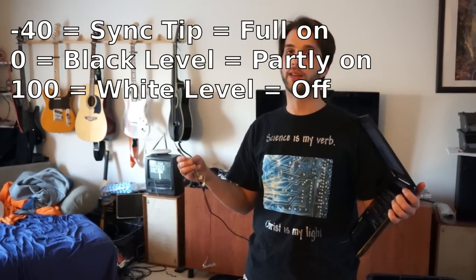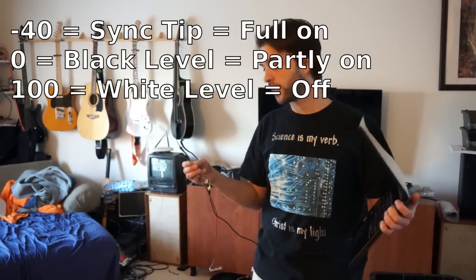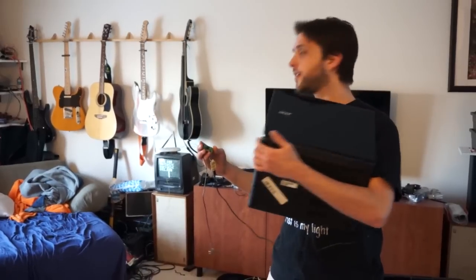You need to have even less proportionally in order to display full white — that's because black level is at 40 and white is at 100. So with this, we can now encode the NTSC on the AVR and modulate it to VHF to the TV, without a whole lot of trouble.